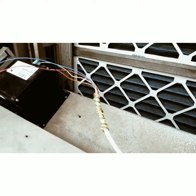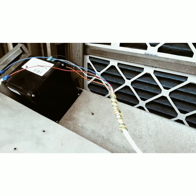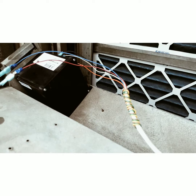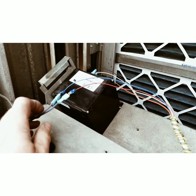I've been in buildings before where they've run ten-conductor wire and only needed six. I've had a short on one of those used wires, and what I did was instead of running a whole new wire through three or four stories of building, I just used the spare conductor that was already there. Works out perfectly.